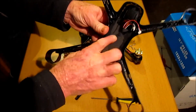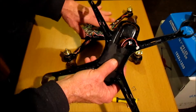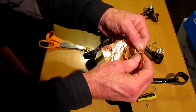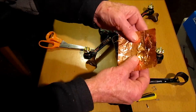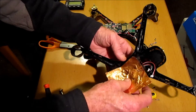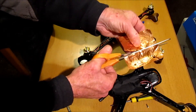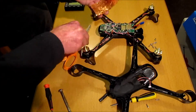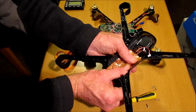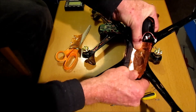I'm going to put some copper shielding on here. By using copper shielding, it will help prevent interference with the GPS module. Here I've got some copper shielding tape - it's sticky on one side and then you've got the shielding over here. I need to put it over the module so that will protect it and shield the electronics away. Let me just cut this out here, then I'm going to stick this on and make sure it's fastened nicely and adheres to that protective layer that's already there.